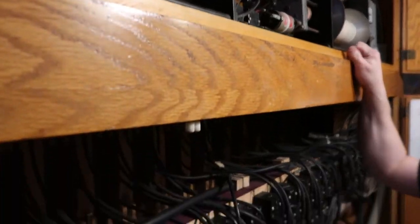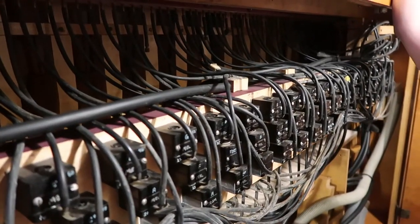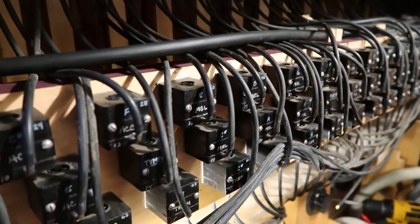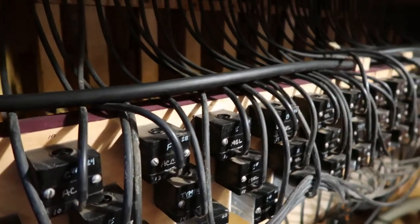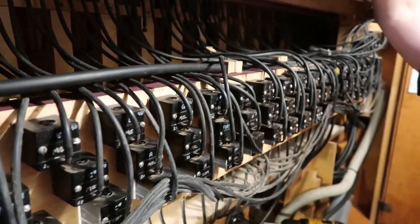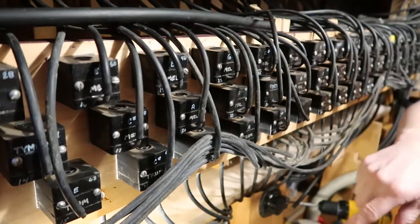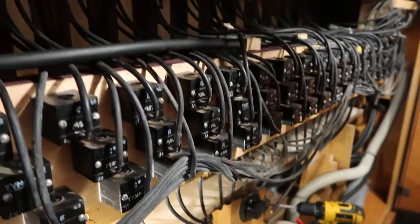You have to depressurize one because if it's pressurized and it rewinds, you hear both what's playing and the other one in reverse. That has happened accidentally in the past. So it has to go through that. Then from there, it goes to each of these valves. So each of these corresponds to a hole in the paper.